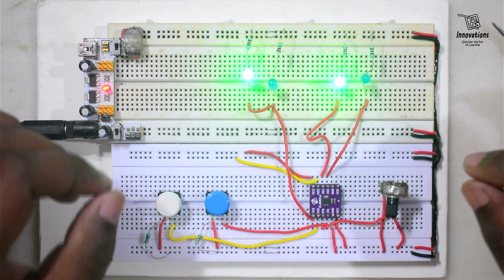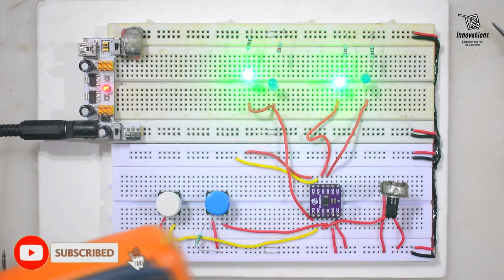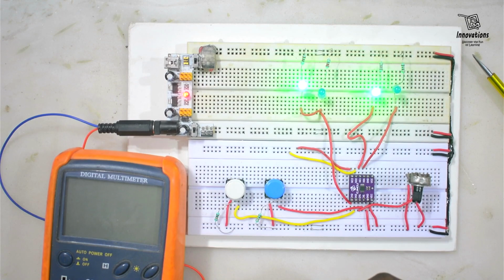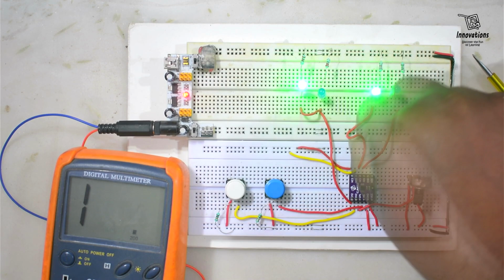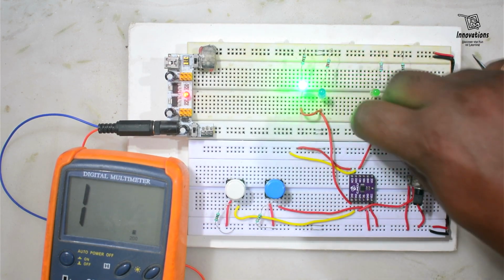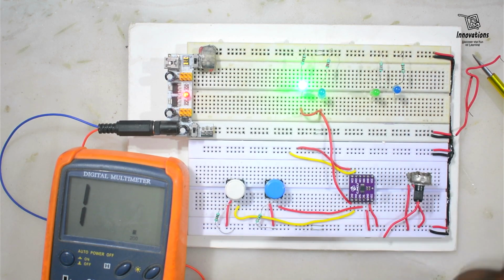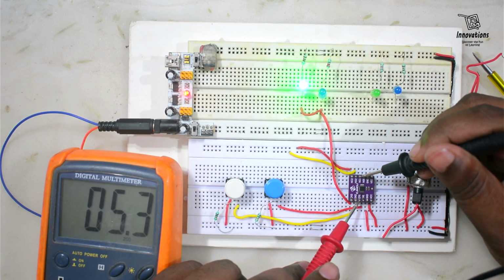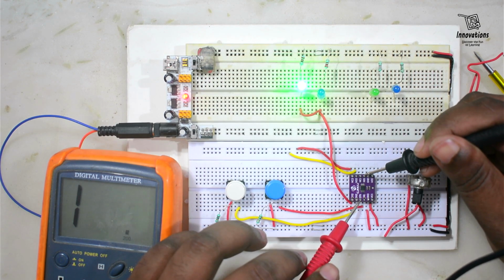Now once we will check the resistance between the pins when there is no load. So I am bringing my multimeter. It is in the 200 ohm setting. So let's check. First I am removing the load from the module and also the voltage from the common pin. Now we are connecting to the COM1 pin and NC1 pin. You see, the resistance is only 5.5 ohms, and with NO pin it is infinite because there is no supply in the IN pin.